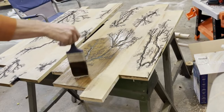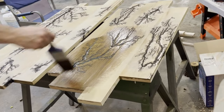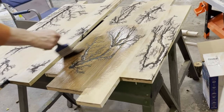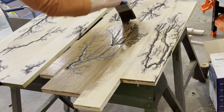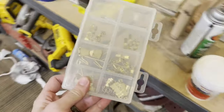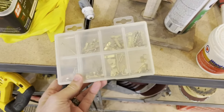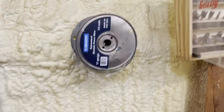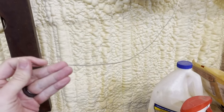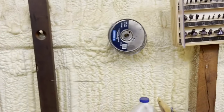With that polyurethane in there, it'll help seal it in. You can still see that pattern just fine - it lightens up a little bit the more you smear it around. It's nice to pick a single direction with the polyurethane product to help hide the brush strokes. To hang these, I've got a picture hanger kit from Lowe's. I didn't have any picture hanging wire, so I'm going to use some leftover galvanized electric fence wire - cutting a few strips, twisting up the end, and putting a screw through it to give a strip across the back to hang over one of these hooks to get them level.